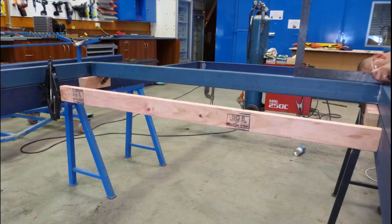We did have some warping in the first frame we welded, between the centre and the rear, due to the heat of the welding process. To line this bent frame up with the new frame being welded on top, we used a car jack and a piece of two-by-four to jack the frame out a bit and straighten it up.